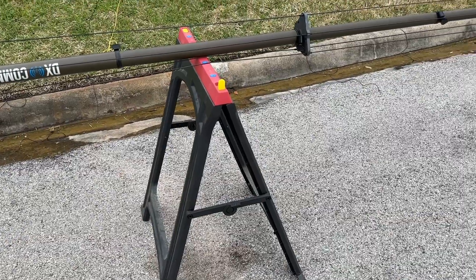I can't stress enough the importance of taking your time to really tune this antenna — it might take you a few hours. You're going to put it up, take a reading for all the bands. If you cut the lengths to what Callum says in the directions — and I'll be honest, I cut mine a couple centimeters longer to account for my lack of ability to measure accurately — you're going to need to tune it. Take all your measurements, take the antenna down, disconnect the radials and coax, put it on some sawhorses, and fine-tune it. You're going to be pretty close with Callum's measurements. I had to tune every single element except for 40 a little bit, but now this antenna is perfect. Every time you take it out, no matter where you are, it's going to be in tune. So let's take a look at it on the analyzer.